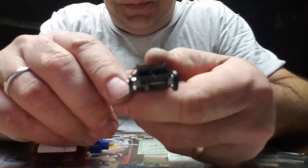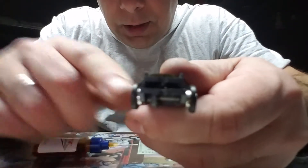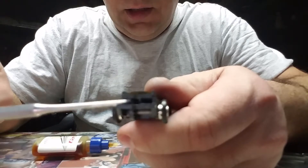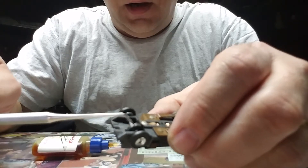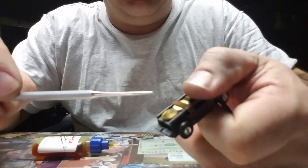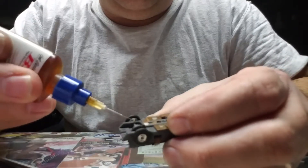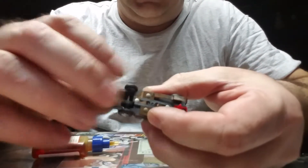Back here there is a gear — it's right in there. If you have one in your hand you'll know where it's at. There's a small gear that drives and spins the larger gear. There's also a small hole where this rod comes down underneath the axle, so you want to try to get just a little bit of oil right there as well.